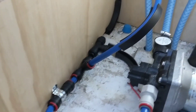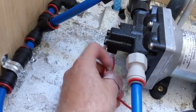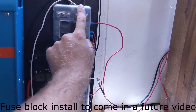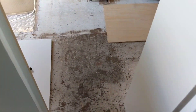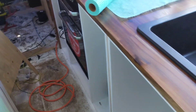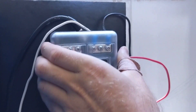This is the wiring for the water pump. Ours came with this red wire disconnected, so I looked it up and found where it goes in. Then the black wire comes out, and I've just attached them there. Then there's a black cable that runs along — it's a bit messy. The negative goes up into our fuse block, and the red one goes off behind our kitchen, over to our switch, which then has another positive wire that goes back past our kitchen into the corresponding positive of the fuse block.